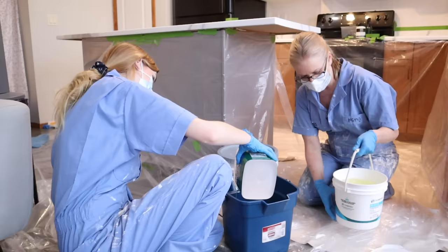I wanted to quickly mention something that happened off camera as a safety precaution. We had extra epoxy left in our bucket — quite thick — and it was having a chemical reaction and ended up smoking, which can happen from epoxy not being mixed correctly. It's really really important to read on your epoxy on how to dispose of it and how to let it cure. Also pay attention to any buckets, towels, or brushes that have epoxy on them because until they're cured they can be really problematic.